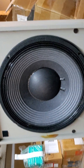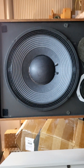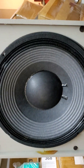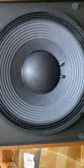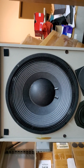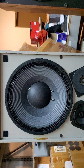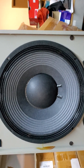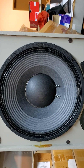I've been listening for a couple of hours and A/B'd it with a 2213. Not a whole lot of difference. In fact, they're a bit cleaner because of the four-inch voice coil and the 12-inch cone, which has a bit less cone area than the 2213s with their aquaplas. I'll call this a 2207. There are bunches of 2206s floating around, and older symmetrical field geometry woofers like the 2202 would be prime candidates for this upgrade.